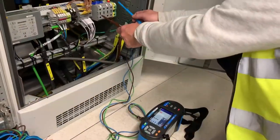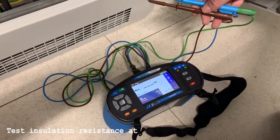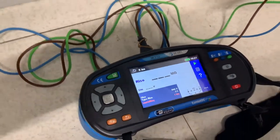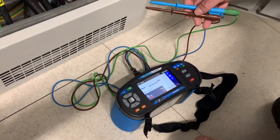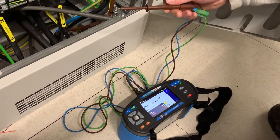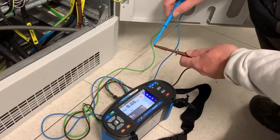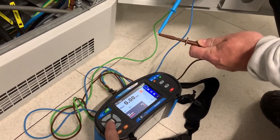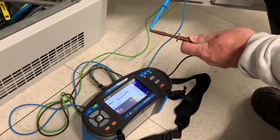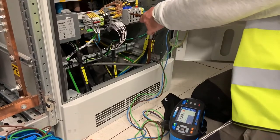We can now proceed to start the test to verify there's no short circuits or earth faults on the panel. We select insulation resistance and set the meter to do a test at 500 volts. First we check with the leads open — the result is in excess of 999 megaohms. Now we check the meter again, this time shorting the connections together — it's detecting there is a short between the two. We confirm we want to proceed with the 500 volt test, and we get a short circuit result of 0.00 megaohms.